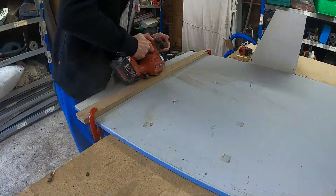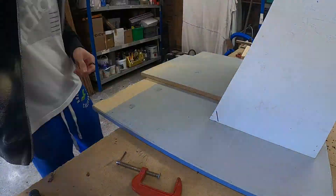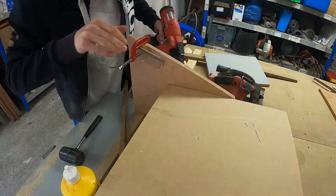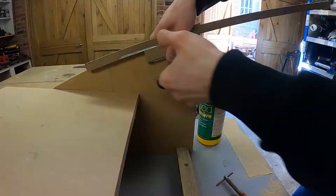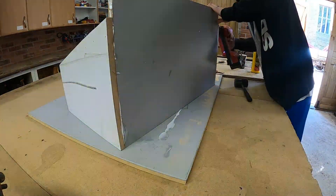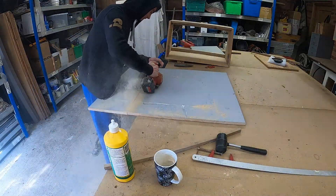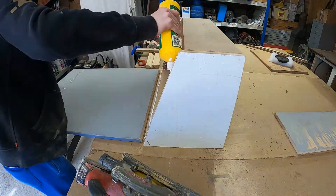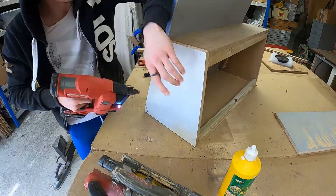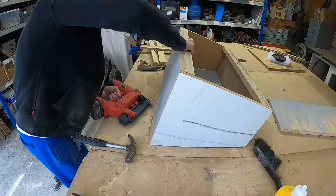So now I'm basically building a base for this thing. As you can see in the top right I've actually started this off camera already, so I'm basically creating just the front, back and top panel for it now. You can see I'm using a very similar technique with the tabs I mentioned earlier, just to give these panels something to hold on to. In this case I opted to use a clamp as well rather than using my hand because I didn't feel comfortable putting my hand that close to the brad nails. I'm leaving quite a lot of overhang on this piece of MDF — reason being I couldn't find anything to actually measure that angle with, so instead I cut it whilst it was attached to the base. I really don't recommend this as it caused me some problems; the cut wasn't quite as straight as I liked. I should have really just done it properly in the first place.